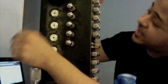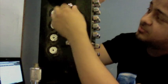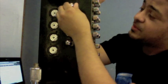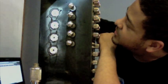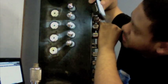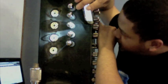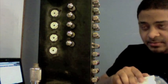On the Carvin V3, the tubes actually go from left to right if you're looking at the amp from behind. So it's backwards from the way we have it. Now, to make sure that we get this completely right, I'm going to take them all off. Reading before you do things is very important. Always double check. V1 is a 12AX7EH. Then we have a Silver Dragon, 12AX7B. And then the 12AY7 and a 12AX7, double matched. By the way, matched will save you time, energy, and frustration. The 6L6s are the ones that I prefer, the ones that Sam now prefers.